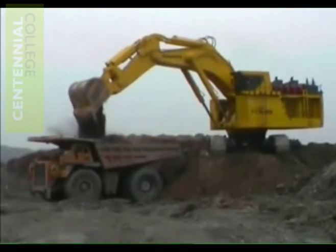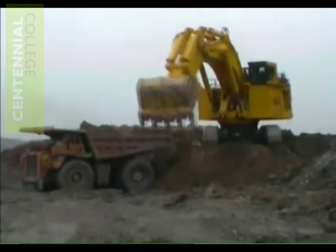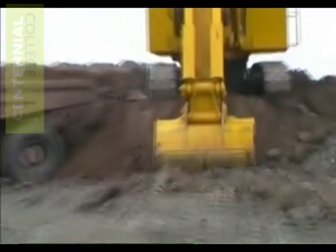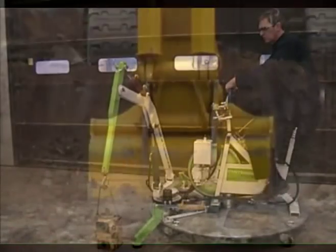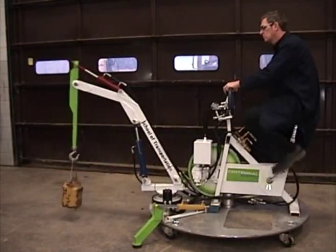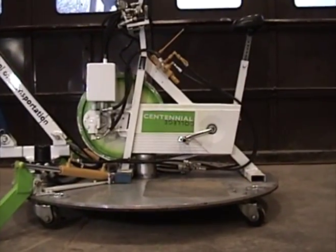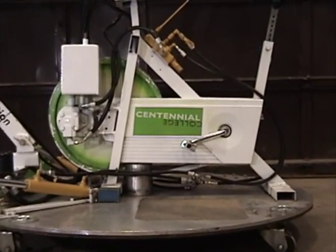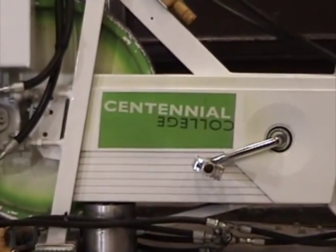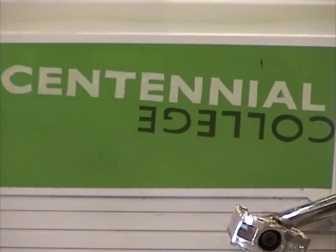Since the flow rate of oil is one of our parameters for measuring hydraulic horsepower, the faster the machine needs to move, the more horsepower it needs from the prime mover — in this case a diesel engine. If you were to operate our crane here at Centennial College, you could see that it takes more pedal effort to move the boom faster than it does to move it slowly. This concludes the description of the hydraulic system of our bicycle crane. If you could keep up with the terminology and understood the way a simple circuit works, you are well on your way to understanding a more complex hydraulic circuit. Thank you for watching.